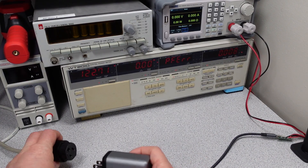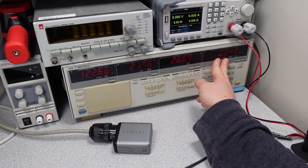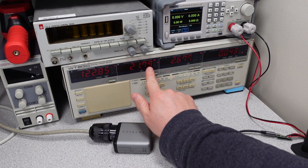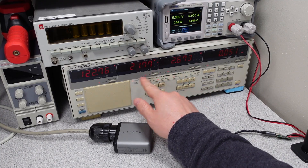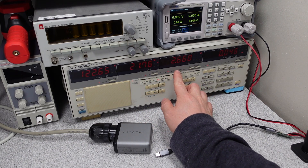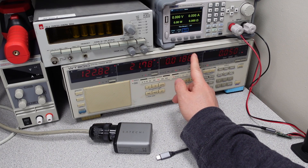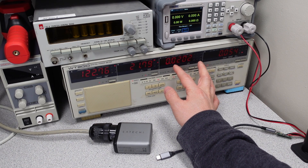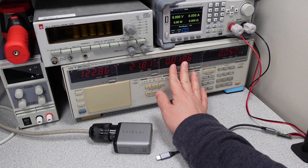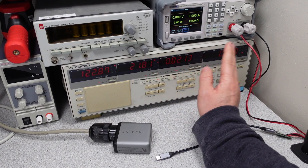I'm going to plug it in. The unit is plugged in — we can take a look at the power consumption. We can see it's about 0.05 watts, which is very good. We have a VA number here, which is literally the volts times the amps, and that number is kind of high, so the idle current is a little on the high side — about 2.7 VA. The other number is power factor, which is the division of the watts by the VA. We want to see this number be 1 — that's the best case. Here at idle it's very low, but given the very low power consumption, this is acceptable.